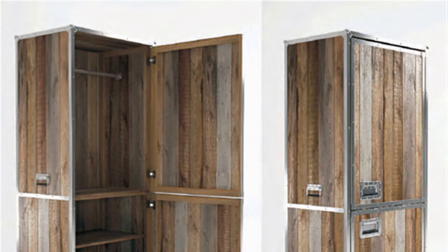When making chair legs, it's important to ensure that they're uniform in terms of shape and size. A template will ensure this. If you're making a new chair leg to replace a damaged leg, remove an undamaged leg from the chair by unscrewing the screws that attach the chair leg to the underside of the chair. Trace its outline onto the teak lumber and use the marks as a guide while cutting the new leg.